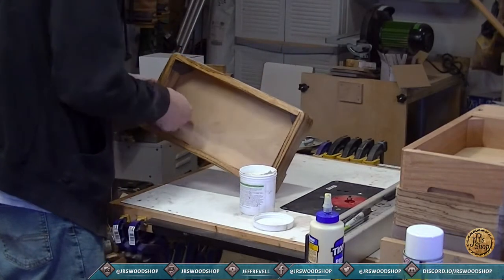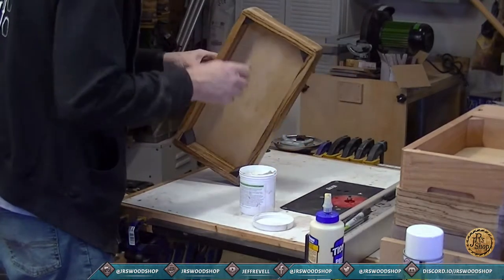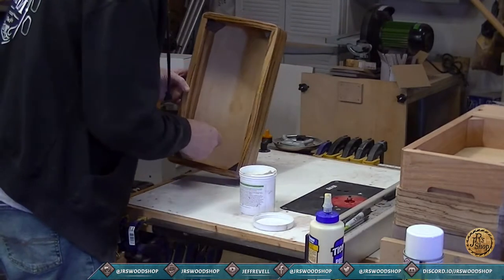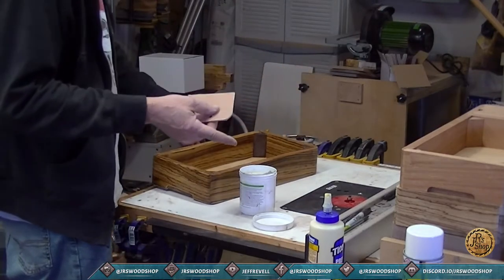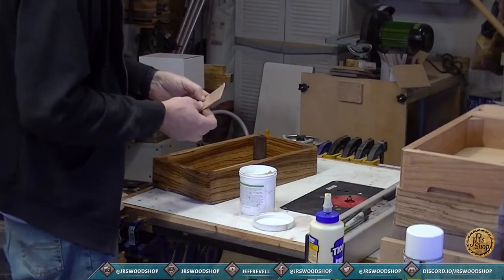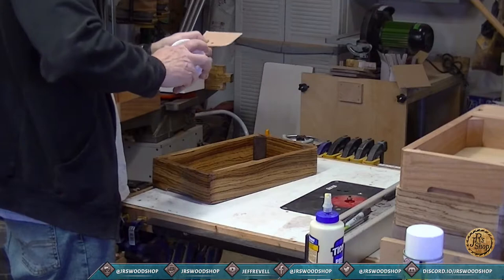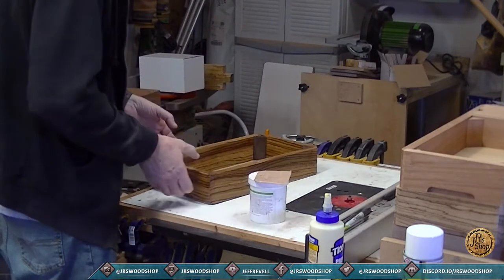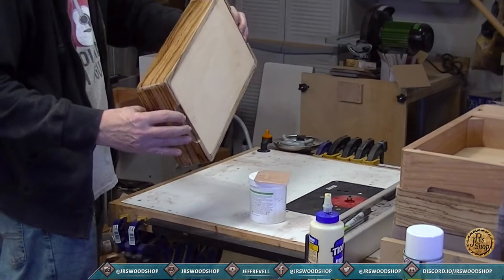There are several woods that I use that are open pore woods. Red oak is notoriously open pored. White oak, notoriously open pored. Even walnut can be open pored, and you can have issues with walnut as well. So, depending on how crazy you want to go with this, you can go to these woods that are considered open pored woods and use this stuff and fill in.